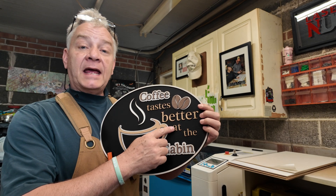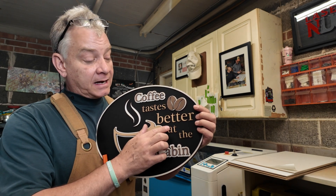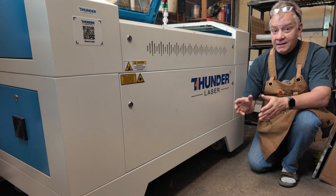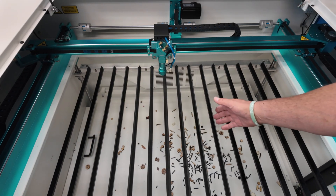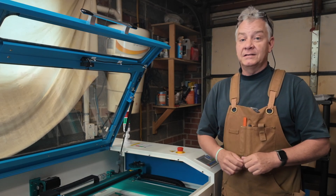For the sign I'm going to be using all six colors available from true flat plywood, as well as some 467 MP, and I'm going to mask every piece. You don't really have to mask true flat, but I usually do with lighter colors like white or linen. In this case the sign has a lot of tiny letters with small wispy pieces, and even though true flat cleans up with water and a rag, it's hard to get scorching off in tight corners. So I'll just mask everything — makes cleanup much easier. Because we're only cutting today, not engraving, I've pulled out the honeycomb table and we'll be cutting on the blade table. I've swapped the six millimeter engraving tip for the three millimeter cutting tip on the bottom of the laser head. The laser's all set up — we're about to fire it up, but before I put any material in, let me show you a few things.